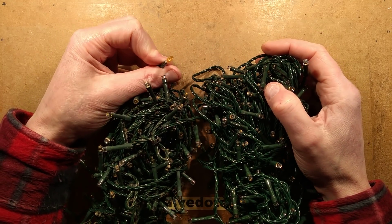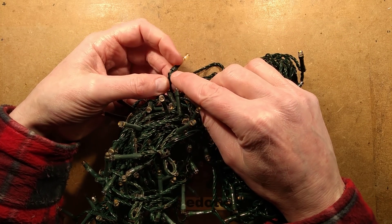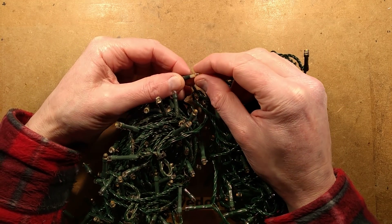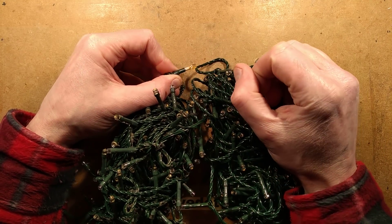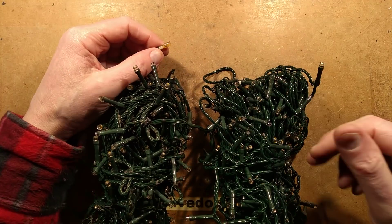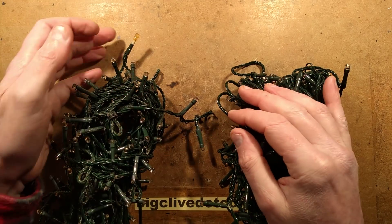DC strings tended to corrode quite quickly — literally within one season, one Christmas. You'd often see water had gone in through the heat shrink and seeped around the end by capillary action. Then because it had DC across it, it accelerated the corrosion — like those fake foot-care things that claim to draw impurities out. There's another video on the effect of accelerated corrosion with DC and water.